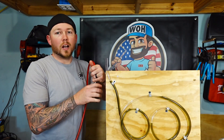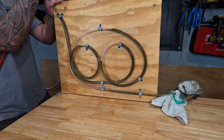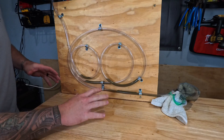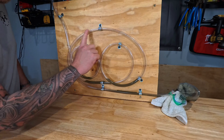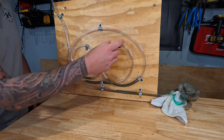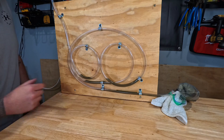Time to run some nitrogen through it. Flushing with nitrogen in three, two, one. As you can tell, we still have a ton of oil all over the system. Not only do we still have oil in all of our little traps, but you can see all through the tubing it is coating all of the walls, even upside down where you have gravity that will eventually help it migrate down. We still have oil all over this thing.